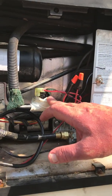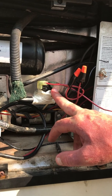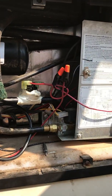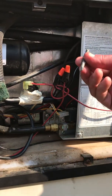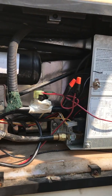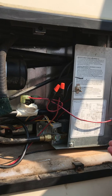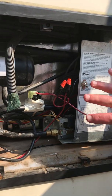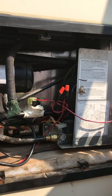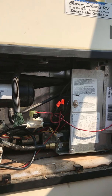From the switch — and this is part of a kit you can get from an RV dealer if you want — I bought an Emerson ThermoDisc thermostat, and it's adjustable. Using a multi-use screwdriver, I was able to get up there and tweak it back and forth so that whenever the ammonia heaters come on, the fan comes on. Whenever the thermostat is satisfied and shuts off, the fan shuts off on its own, so it's not just sitting there running full bore.